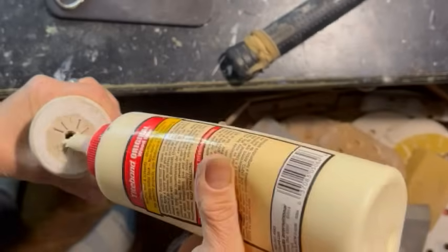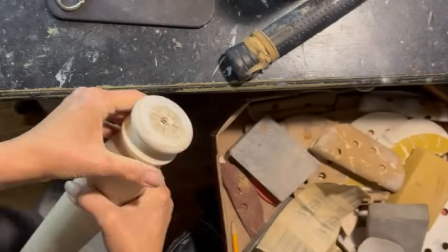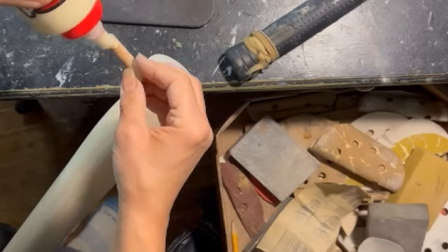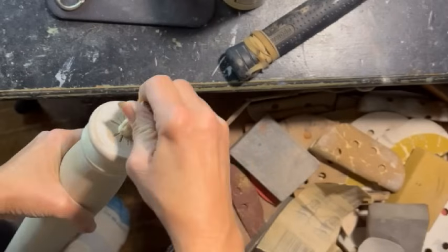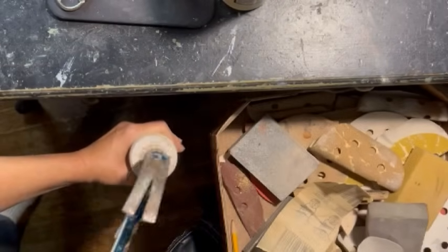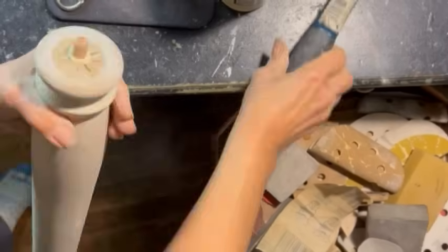Kind of like in the original legs, but not in the same placement that the original legs had the dowels. I am putting them in the same place the hanger bolts were before I removed them. And I'm using some wood glue and a hammer to make this happen. I fill the cavity with wood glue, add a little more on the dowel, and then tap it into place, way down into place, because these need to be solid.